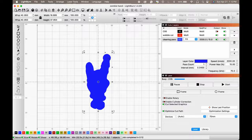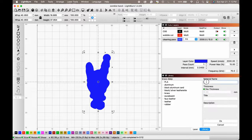We're going to save this cleaning pass. Go to Library > Create New from Layer. This is for my brass. If you want your new settings to save under your existing entry, you have to type the exact same name — if I put a capital B it won't save under the existing 'brass,' it'll create a new one. So let's name it: 'Cleaning pass for brass on 70mm.'